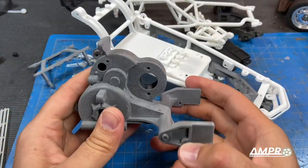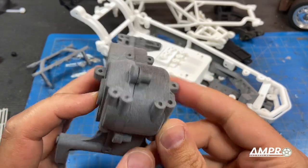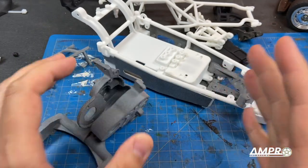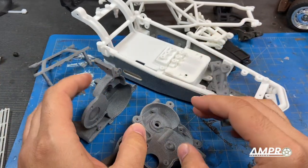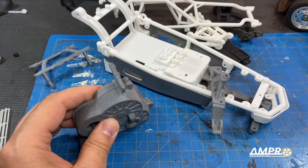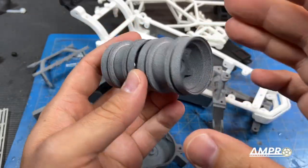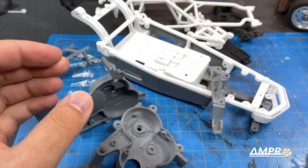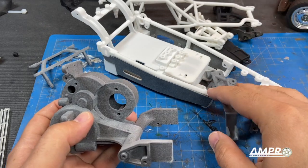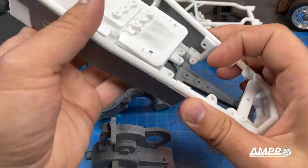So this transmission is for a complete double wishbone rear suspension. Geometrically, it was quite complex to get to work in this lower area, mainly because I wanted to pull the rear track in to allow the car to use the factory Hornet tires at the rear. This means it requires a modified rear rim to get it to fit all the geometry and all the suspension components in there.